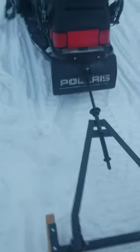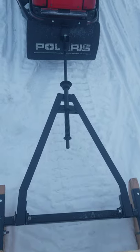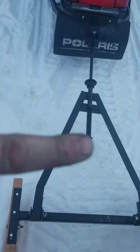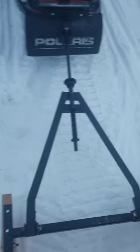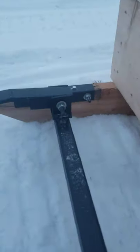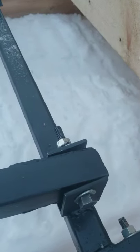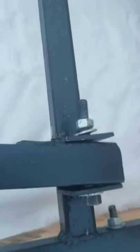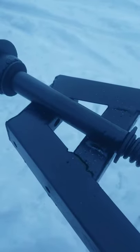The harder part was the actual trailer hitch — I went ahead and welded it up myself. It's a 30-inch span for the A-frame. That's a piece of angle iron, or actually old bed frame inch-and-a-half square tubing, with some two-inch angle iron and flat bar welded to complete it as a C-channel, bolted in and supported with the inch-and-a-half square tubing. I cut it and bent it so it came up in the middle — it's four inches wide.